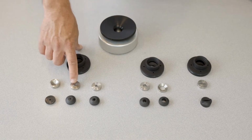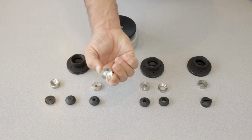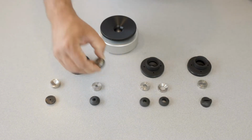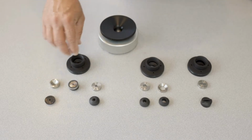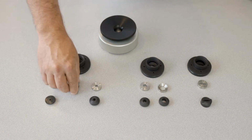The next one would be the 1/8 inch sealing system. And here's the compression gland insert and the gasket. And those two again just stack up like that, drop in there. And we do put a little friction washer right on the top of that just to keep the parts from galling each other as they tighten down on those parts.